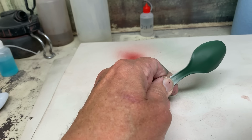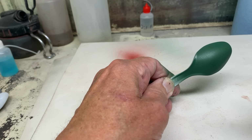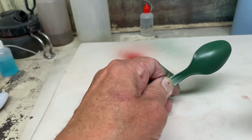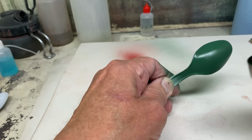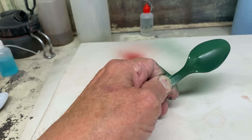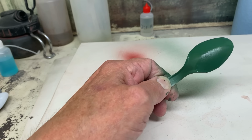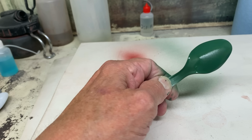So I'm going to go ahead and apply a third final coat here, a bit heavier, so that I can really count on this self-leveling and really smoothing out as it dries. So my first reaction is, yuck! There's so much orange peel here. But the proof will be what I've got when it's had a chance to level, self-level, and dry.